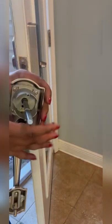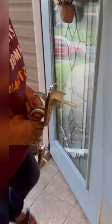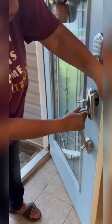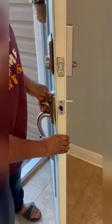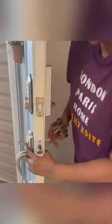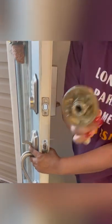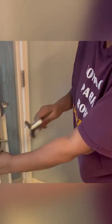Now I'll attach the outside handle by aligning the holes that are inside, pressing it through, and pushing the bottom through. Once you get it in, hold it in place — make sure it's snug against your door at the top. Then put your lever on by aligning it with the outside handle. Use the two larger flat-top screws, one at the top and one at the bottom.